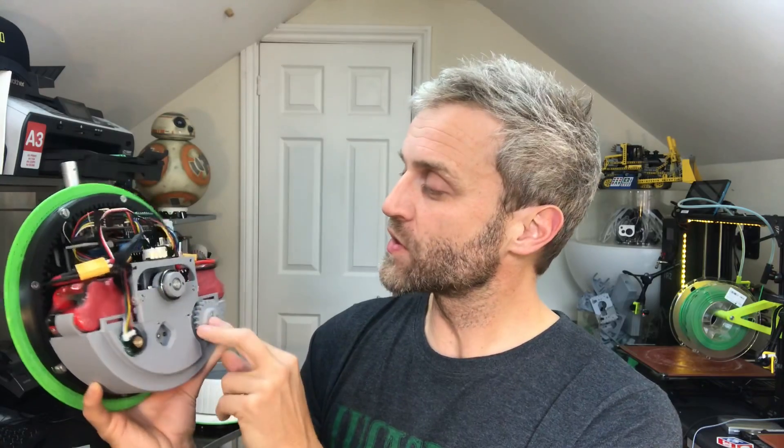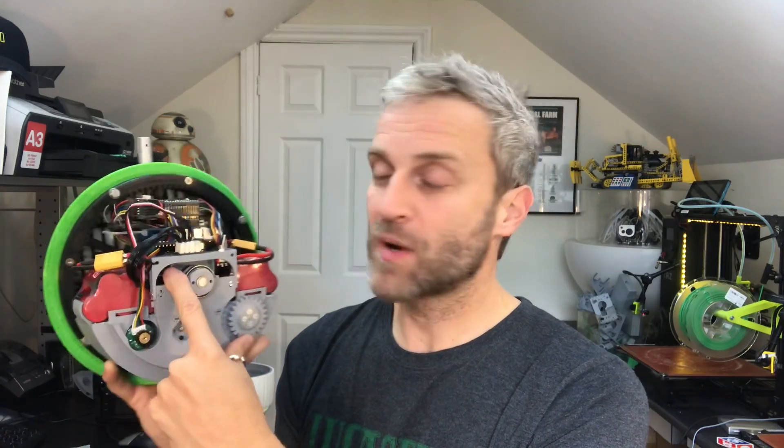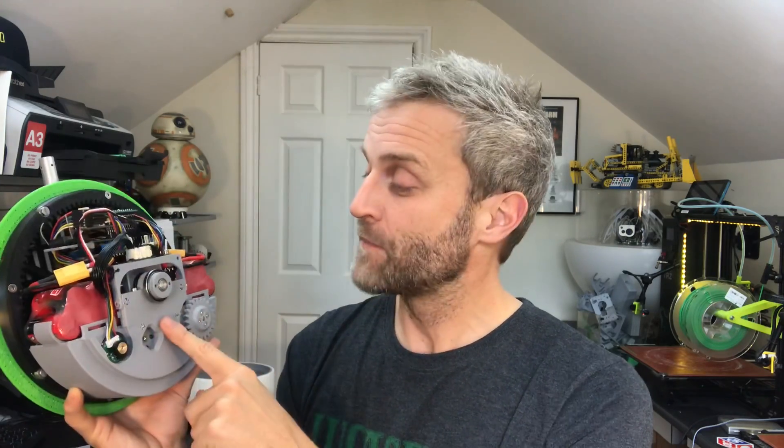To counteract the speed loss, I've upped the voltage on my DC-DC converter. The converter is set at 12 volts output as standard, but by adding a 330k resistor between the trim pin and the positive output, I can increase the output voltage to around 13.8 volts. This increases the maximum torque and also the maximum speed by 15%, regaining what I lost in the gear reduction, plus an extra 15% power — so overall about a 30% increase in power. I think that's what I'm going to stick with for now.